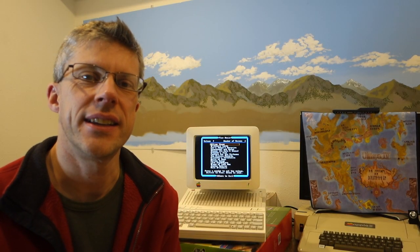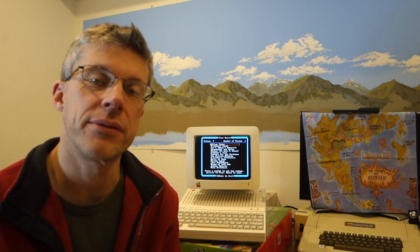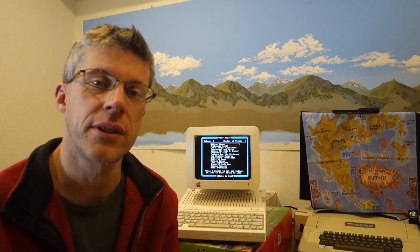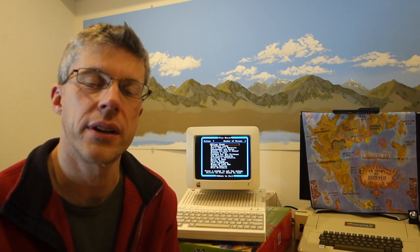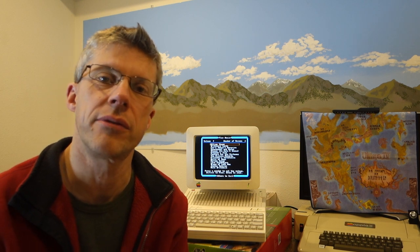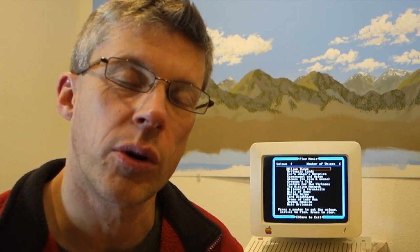The conversion of my Apple IIc to the Mockingboard 4C was a success and I now have stereo output from my Apple IIc for those games that support it. Ian Kim's board is excellent, the installation instructions were great, and I just had to make a couple of modifications: first you have to solder a wire to the motherboard — that was pretty easy — and then there was a little bit of interference from the board itself, which I fixed by putting a couple of 47-ohm resistors in series with the speakers. Ian Kim has some instructions on how to get games working properly with the Mockingboard, because the Apple IIc normally expects a mouse card to be in slot 4, so for some games you have to do a POKE command to get it to recognize the Mockingboard.